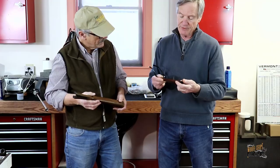I've got to glue up a couple cracks in this gun stock, maybe 4, 5, 8, 10 thousandths at the most across. And I was asking Mark one day here recently, what would be the best way to get in and clean out the residue, the oils that are in those cracks, because I have to epoxy them together. The first thing I think is we need to extract the oils.